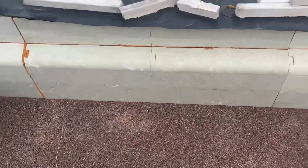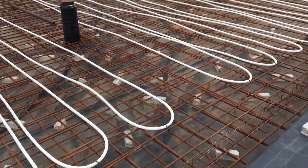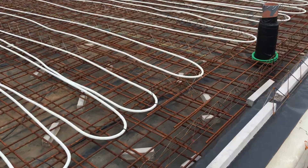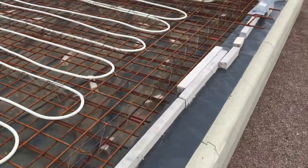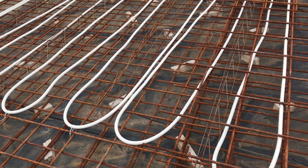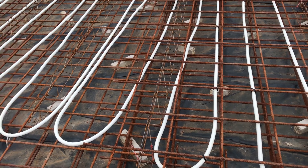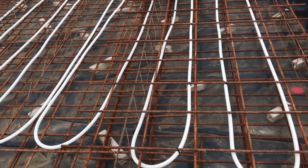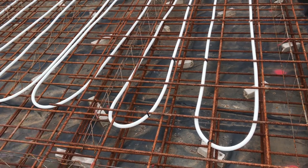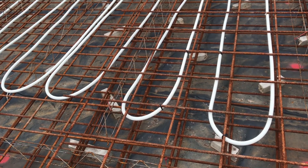Isoquik Foundation. We've got heating pipes inside the structural slab. There are little chairs holding the mesh up, and there are heating pipes through it. I didn't want the heating pipes too deep, so they've been attached to the top two layers of mesh on the underside. Just bringing them up and cable tying them — but the chairs do get in the way, so you've got to pre-plan it so they don't hit the chairs and you can get through.